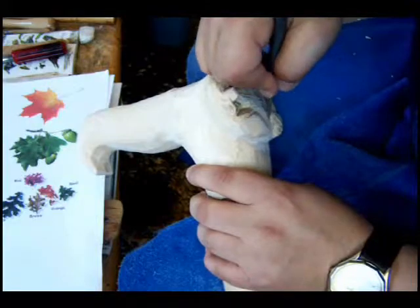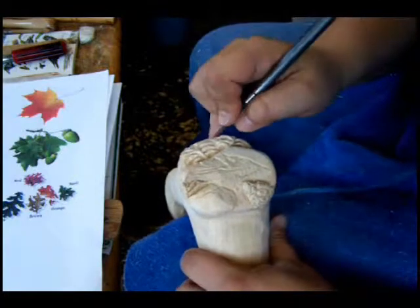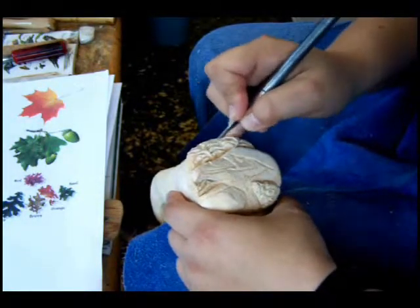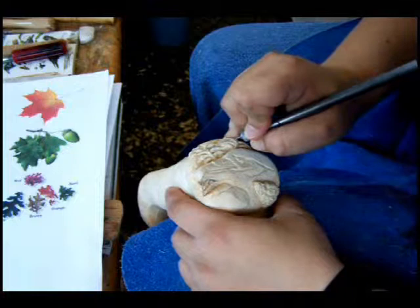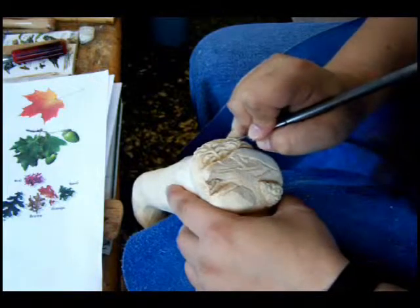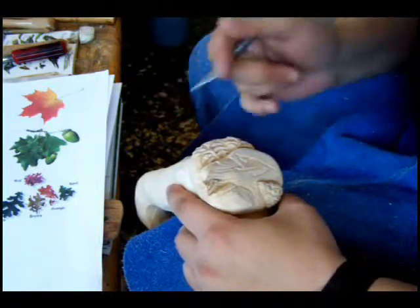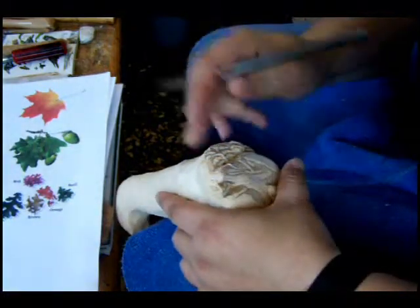And that will help to give it a three-dimensional look. So we're going to go ahead and undercut all around the pine cone, and we're also going to undercut very carefully around our pine needles to give them a bit of a raised appearance. You've got to be very careful doing undercutting on areas like this because you don't want to cut too far underneath, because the needles are very thin. And if you cut too far underneath, then you're actually going to lift the whole thing off. So anyhow, be careful there.